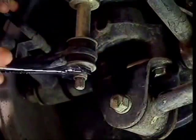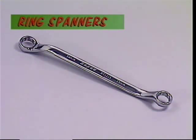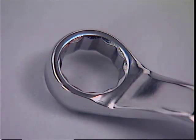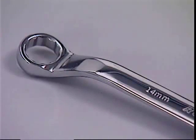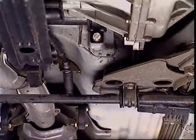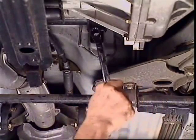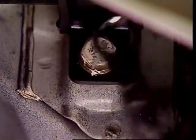Pull a spanner towards you rather than pushing it away. Ring spanners grip a fastener at the corners just like a socket spanner — the sort of grip needed if a nut or bolt is very tight. Ring spanners have different sized heads at each end; they aren't as convenient as a socket, but they'll go places a socket can't and still let plenty of force be applied. One disadvantage is that they can be slow and awkward to use once the nut or bolt has been loosened.